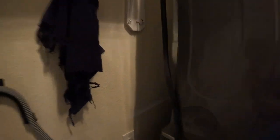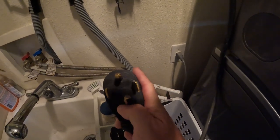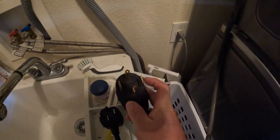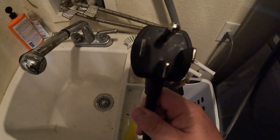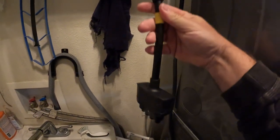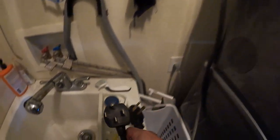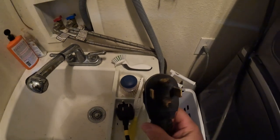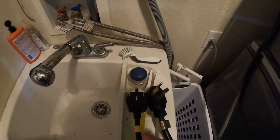My dryer is stacked, and there's the plug back there — kind of not easy to get to. When I pull it out, I have this end with a little half-square shape. That's a NEMA 14-30. There's NEMA 14-30 and NEMA 14-50. The adapter that comes with the Ford mobile charger for the Lightning is for NEMA 14-50, so I can plug it into 220 — but I can't plug it into my dryer outlet, even though my dryer is 220. The plug shape is different.